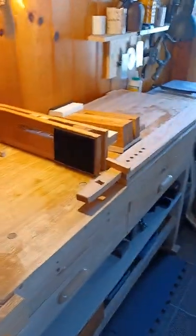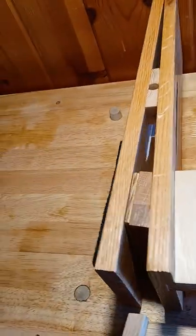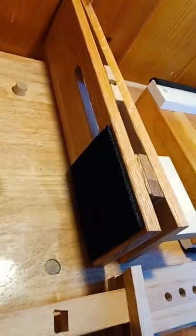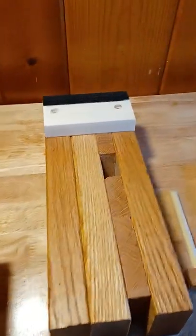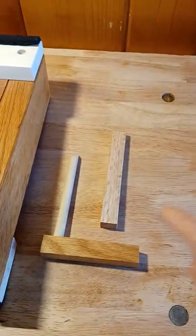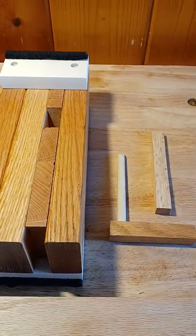And then on the bench I've got our pony. There's the long arm that is going to articulate the vise. It's basically a big wedge with a little fin on the bottom that'll be held by that vise. On top there's a little piece of cushiony fabric that's going to hold wood in place. And here's the head that goes on that arm to hold wood down, plus a little tenon to hold the head on, and an axle that'll go into a bearing on the wedge.